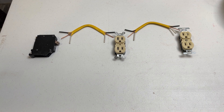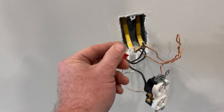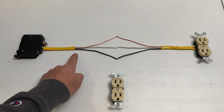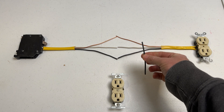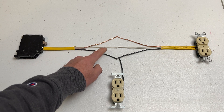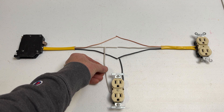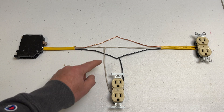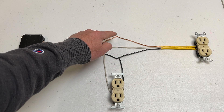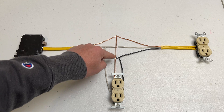While you can totally do it this way, if you open up the other outlets in your home done by an actual electrician you'll notice they're done a little differently. The hot supply line comes into the electrical box but it doesn't connect directly to the outlet. Instead, the hot black wire from the supply line connects to two black wires in the electrical box — one runs to the outlet for that box and the other continues the circuit on to the next outlet. The same happens with the neutral white wires: the white coming into the box also doesn't directly connect to the outlet; instead it connects to two other white wires — one to the outlet and one continuing to the next outlet. Same with the ground wires: a short ground jumper wire coming off the outlet connects to the two ground wires from the Romex coming into the electrical box, and they're all twisted together.